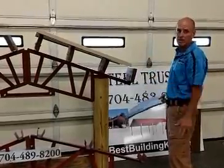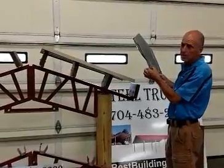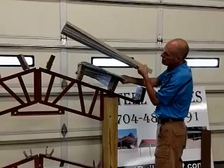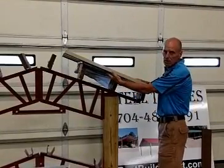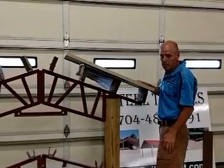It just starts raining inside your building, and you're not going to be real happy with that. So they have a thin insulation. It's like 3/4 inch foam or double bubble that we do sell. You would drape this across your purlins, put your metal on there. That just slows the reaction between hot and cold, just like the foam koozie that goes around your soda can. Stops a drip of water there.